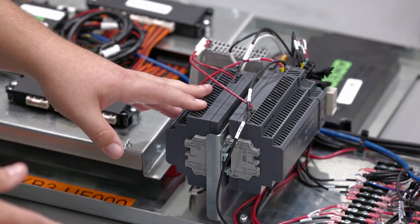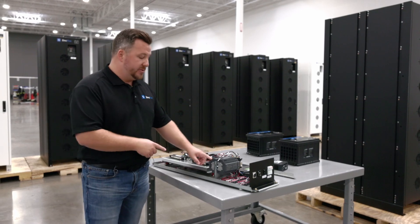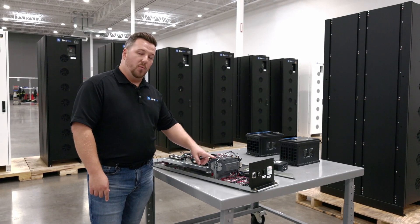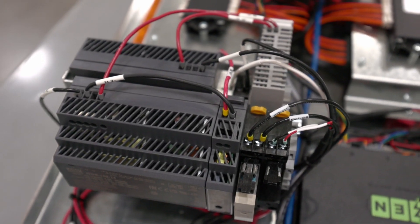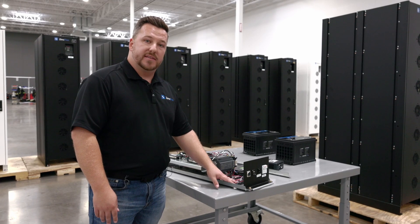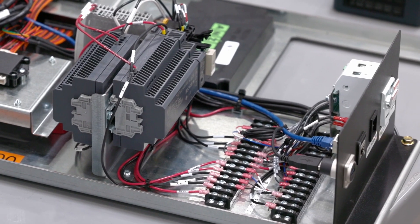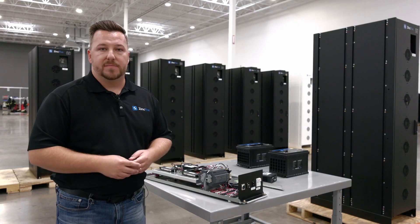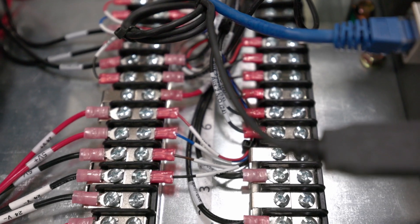In terms of power source, our battery cabinet is standard with a 110–240 volt AC power supply. However, we do have an option to add a second power source — either a 110–240 volt AC supply or a 600 volt DC power supply. So you have the option for redundant power supplies and potentially redundant power sources for the BMS. We also provide terminal strips with access for dry contacts as well as UPS breaker control. Depending on your UPS manufacturer and whether they use shunt trip or under voltage relay, we have the ability to support both.